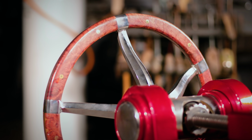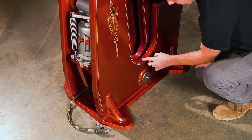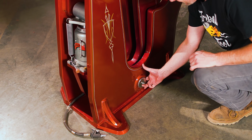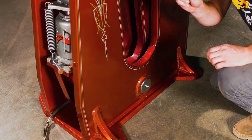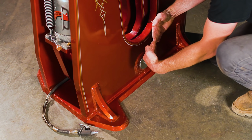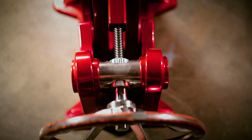Another question I want to address is that this meat between the pin and the top of this frame is too thin and it's just going to break right off. Well, let me tell you what it actually measures. That's 8.5 inches of 1 5/8 plate times 2, so that's over 3.5 inches thick plate, plus this 3/4 that it's sitting on that you're going to have to bend. All with a 16-inch little tiny wheel over here with a little 1-inch screw.